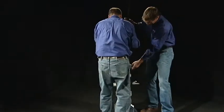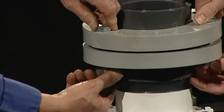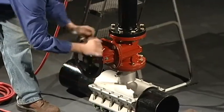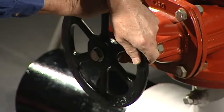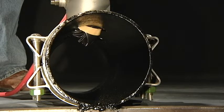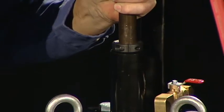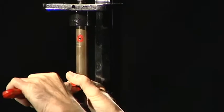Install the launch cylinder onto the full port valve on the pipe tap. Open the tapping valve to equalize the pressure between the launch cylinder and the pipeline. Push the plug into the main pipeline with the inflation ram until the plug position lock collar is against the inflation ram packing seal.